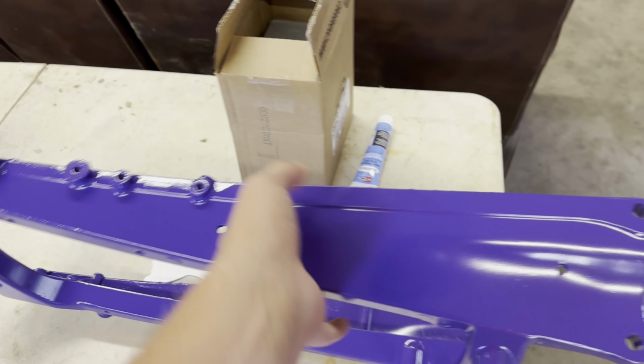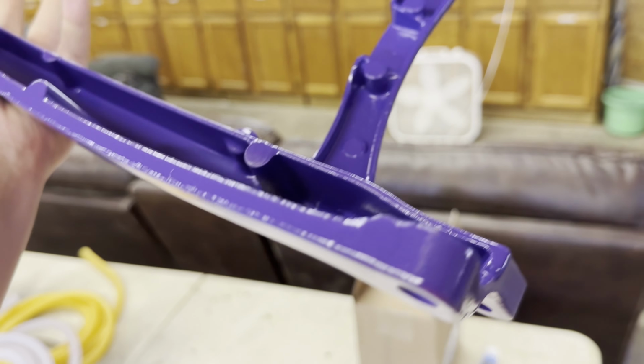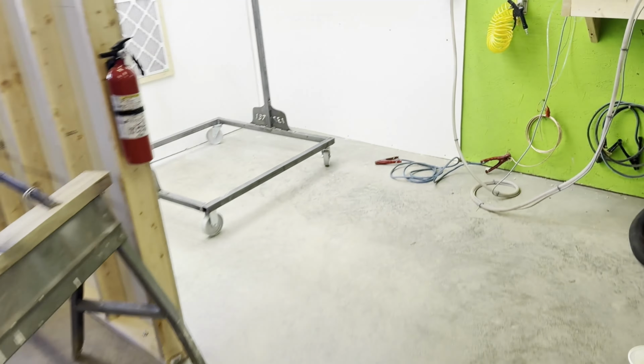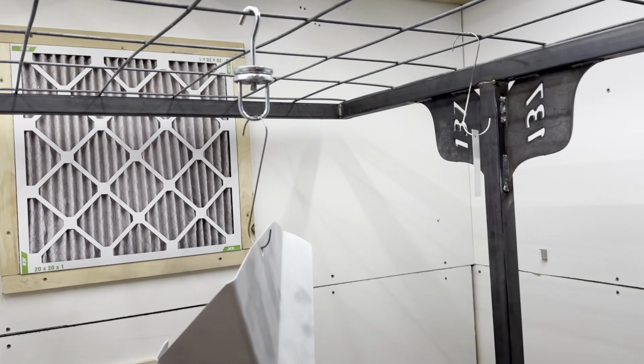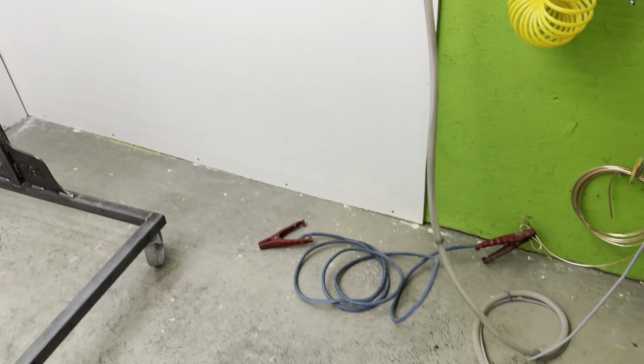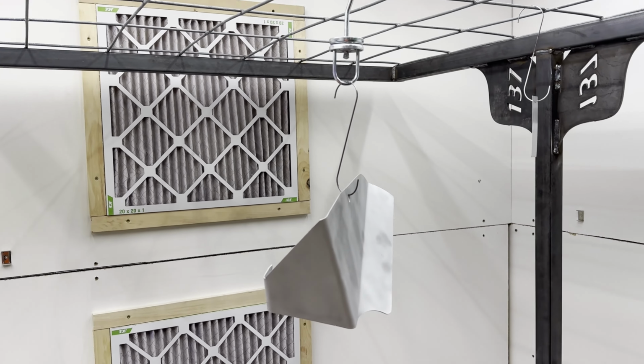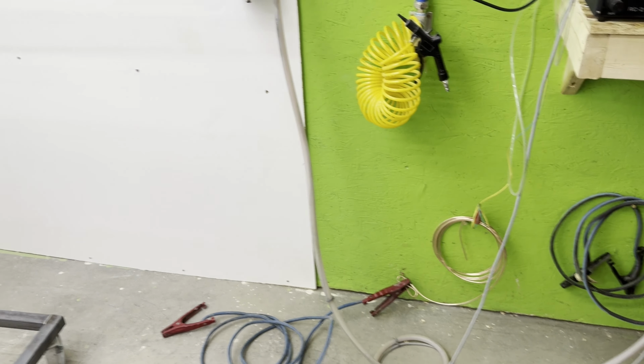It looks really good. So the issues I had previously, the problem areas were down in these little crevices, and there's a couple of real fine bare spots, as you can see. But overall, it's a ton better than it was the first time. So that's really good. What my problem ended up being was just our ground. So I was right, the coating on this cattle panel material wasn't giving conductivity between the ground clamp and the parts. So after I ground the top of those down, we have good ground going from our parts to our ground rod.